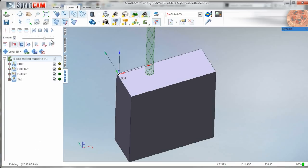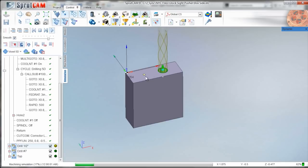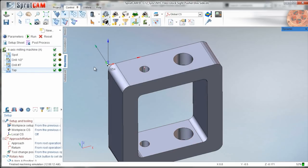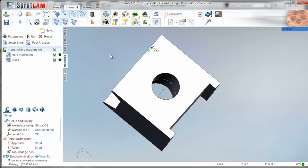That'll look something like this - there's the half-inch, number seven drill, and then tapping it quarter-20. We'll flip it over and do the same. Then for our little slide pusher piece, the first thing we'll do is machine our hole.